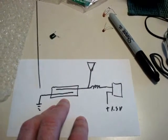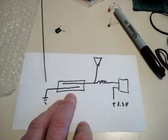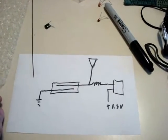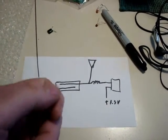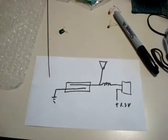Just about anything will trigger a coherer tube — any electric spark or hash, motors with brushes, vacuum cleaners, blenders, drills, anything that has brushes and sparks and arcs, the electric igniter on your furnace, and the piezo in an electric lighter. Almost all lighters these days have a piezo igniter in them and those will work too to send hash through. Just about anything can trigger it.